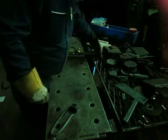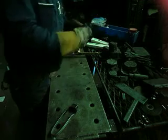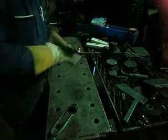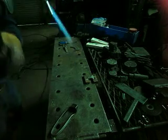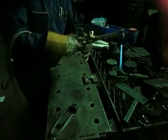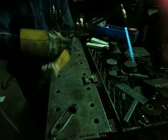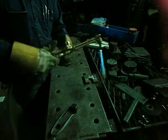Let's try it on a piece — there's a piece of half inch. It's got 40 psi oxygen. One little trick: you can loop your hose over your arm if it's going to catch on something, or it's more comfortable and you've got more freedom of movement this way.